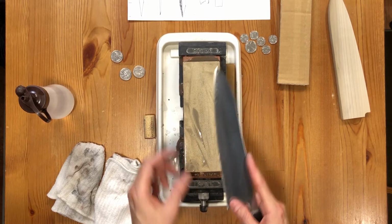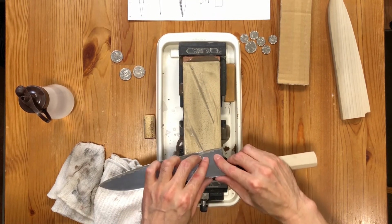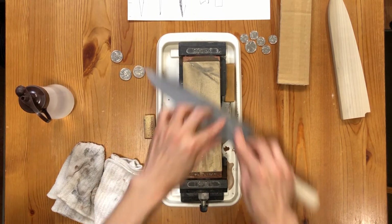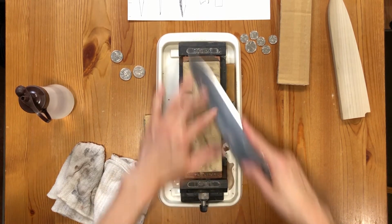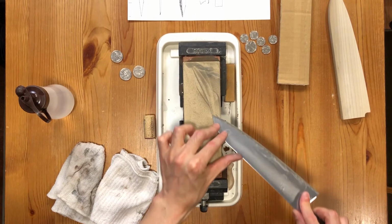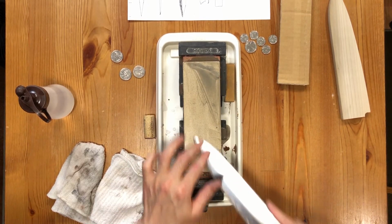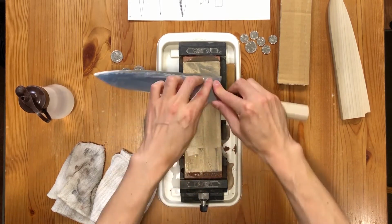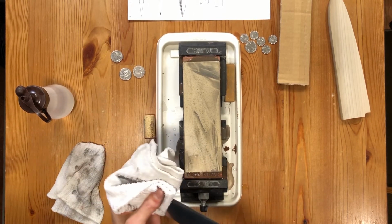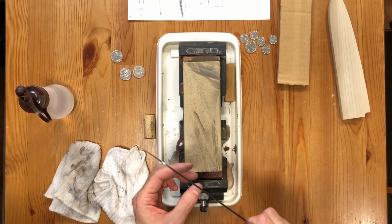This is not the stone set I usually use. I typically use different stones when I'm sharpening, but this is a great beginner combo stone. Also comes with a base, so you don't even need anything to raise it, which is sometimes nice to have. The main thing is for it not to slip. So the base has some rubber feet that allows it to stay in place. And this stone is quite inexpensive, perfectly adequate, but you can always upgrade your gear, of course. And the better stones have a little bit better performance. It feels better and it cuts faster and has a smoother end result.